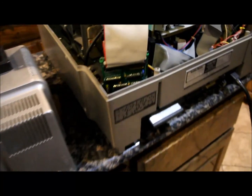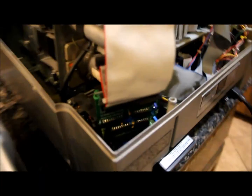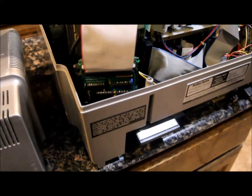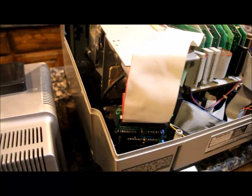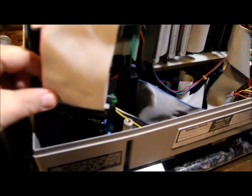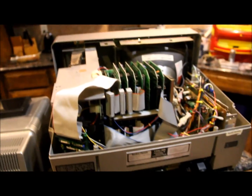I've started it back up and you can see it fits down in there. The cable doesn't short out against anything because of the plastic on the back of the card. You can also put the lid on — it's easy to take off, just two screws. Unfortunately one of the screws for the back is not the original — one is black and one is silver — because one was missing when I got the machine. The disc module is now hidden inside, so it's basically got a hard drive built in.